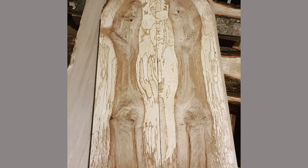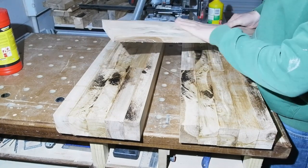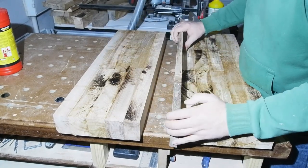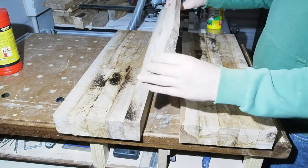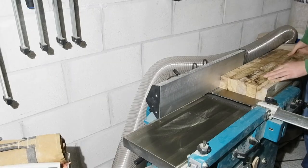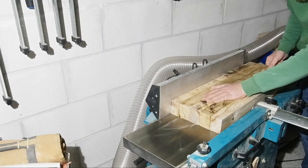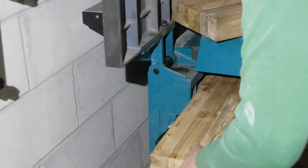When I planked the pieces, some were clean, straight, rich golden grain; others were infected with the fungus, giving rise to some interesting spalting. The planked pieces that make up the top were about 50 mil thick. I did a few thinner pieces too, like this one around 18 mil thick. I'd quite like a slot in the bench top to park chisels, so I'll create that using this piece. First I need to clean up these blocks so when it all goes together I can see it flat and have nice planed edges to join down the center.